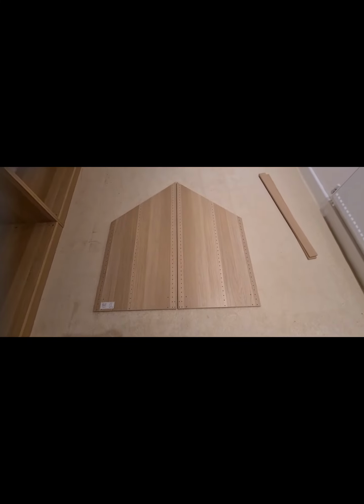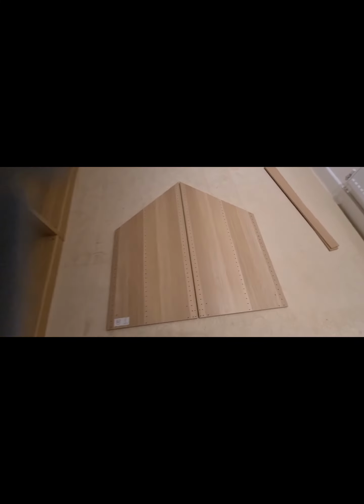Then you draw the line here, cut the bottom piece again after you remove this, and we'll take it from there. That's what it looks like once it's marked. Remove this one now, put it on the side, you don't need this now. Take this for cutting across this line. So after you've cut both pieces, line them up next to each other like this. Rough edge on the outside, both clean, nice edges on the inside, rough edge on the outside.